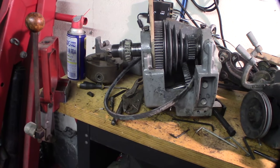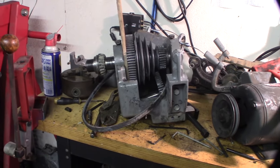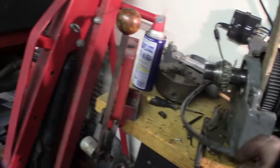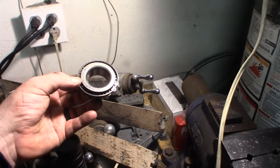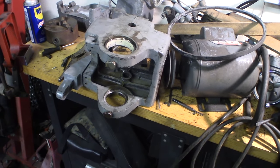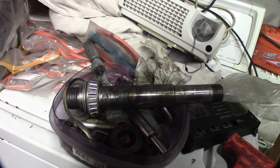I finally got it through - I was chisel-easing this off. The nice thing about taking apart your own lathe is there's no mystery - I've taken this whole thing apart piece by piece and I know exactly how everything works mechanically. The whole belt situation - if you've got to replace this belt you've got to do all this every single time. Look at this - Timken, made in USA. You don't see that very much anymore. I think I made a video about Timken basically charging premium prices but making overseas now.